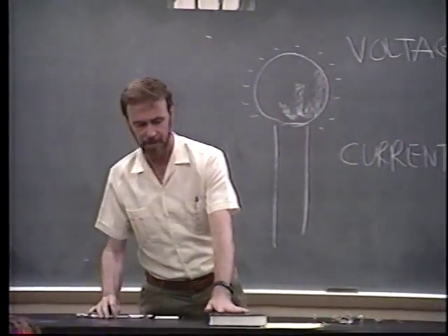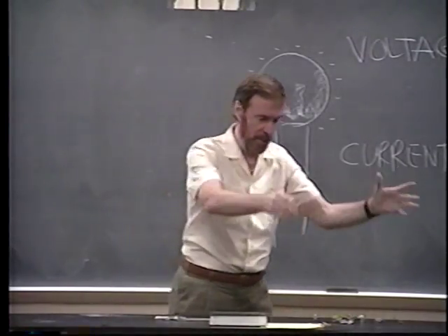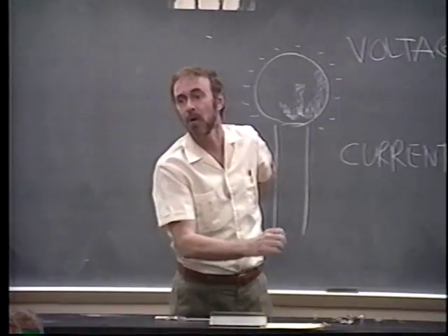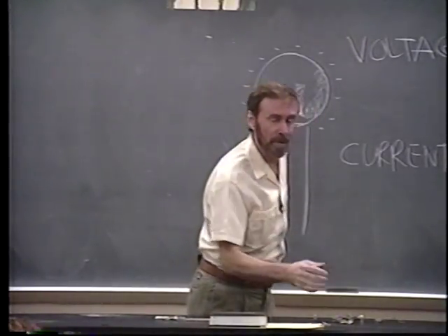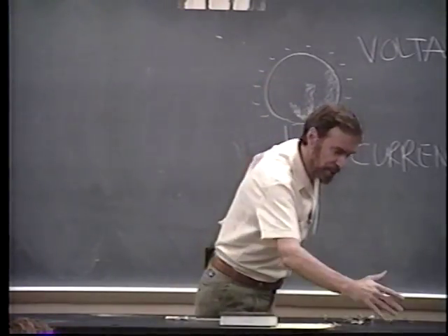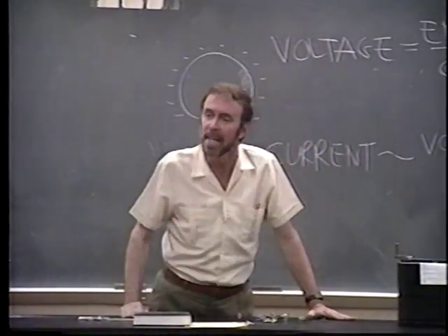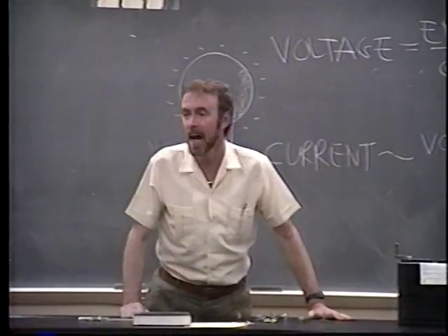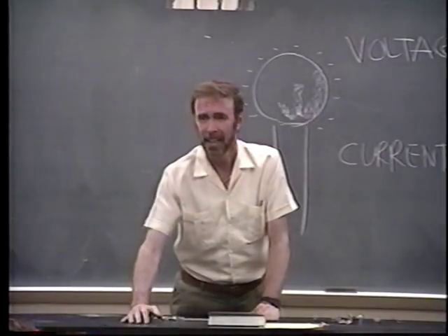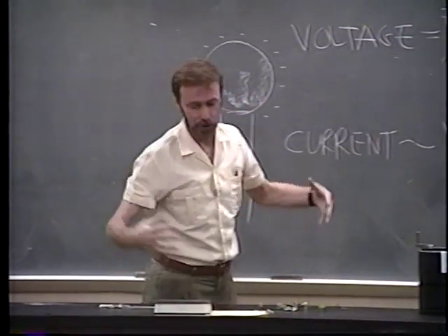When I was a little kid, I learned about some of this stuff from a neighbor. Across the street was a guy that used to fix his car all the time. He'd be doing electrical work, and I noticed what he'd do — he'd put his hand behind his back when fooling around with the coil, which is high voltage, more than a thousand volts. He'd make sure one hand was behind his back. I asked why, and he said: I put my hand behind here because I don't want to touch a high voltage and have my other hand on the car. Because then the voltage would be between this hand and this hand, and what's in between? Your heart. You don't want current flowing through your heart. That's the worst thing. As long as he touches like this, the current might go from here right down the foot — he'd be hurt, but it don't go through the heart.